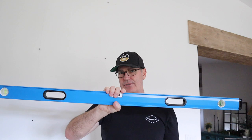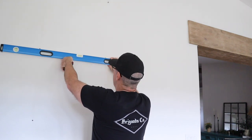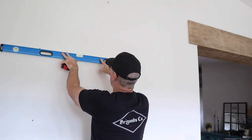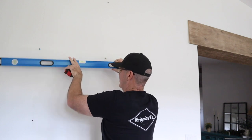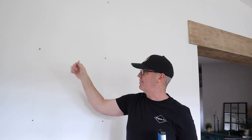I don't know where level is, so I draw kind of a vertical line here. I then grab my four-foot level — a two-foot works, but this would be painful and not as accurate. I take where my point is and just level this and score it across. So I've got a horizontal and a vertical line where those two meet. That's your 22.5 inches away from your center point. And I do that going up, down, left, and right.